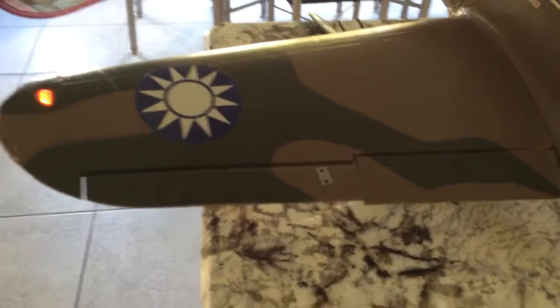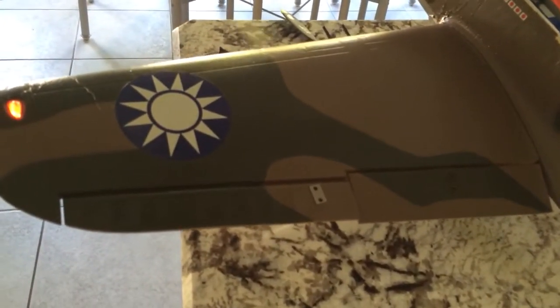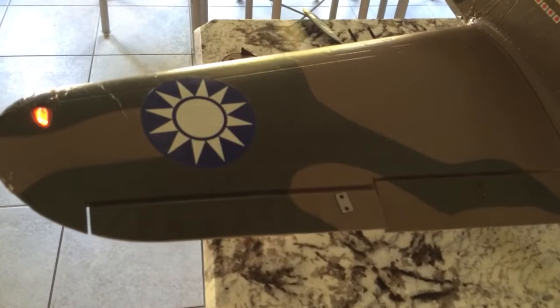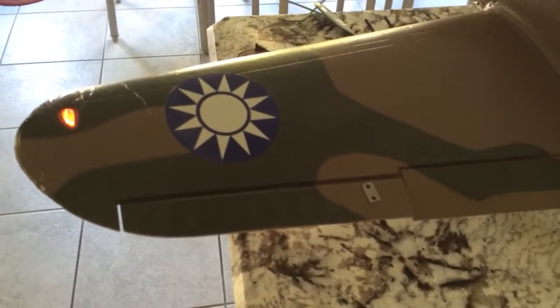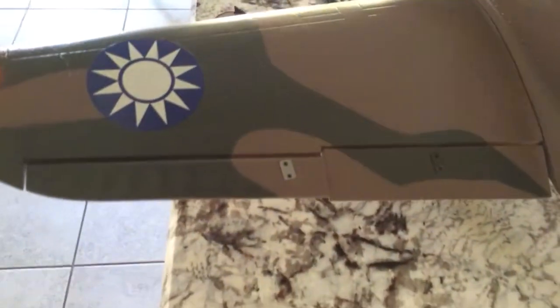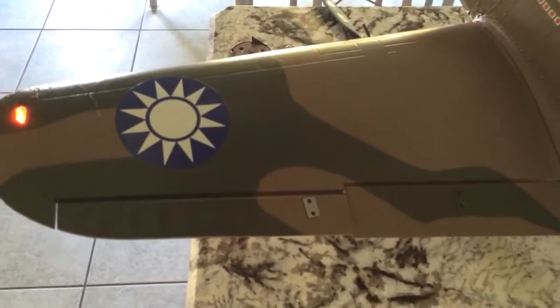I'm going to isolate the servo. I don't know if it's that board in the middle that ties everything together. I'm going to run this servo directly to the radio on aileron and see if it still does it. If it does, I'll send the video. Maybe it's that three-way Y-flap slowdown board that's buried in the middle of the wing that ties everything together and makes it all neat — it could be that thing that's bad.